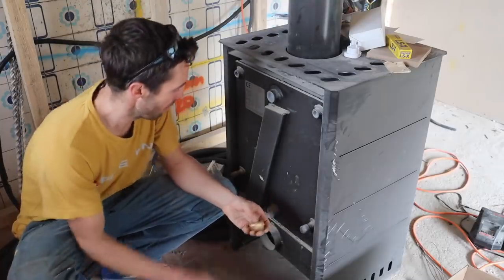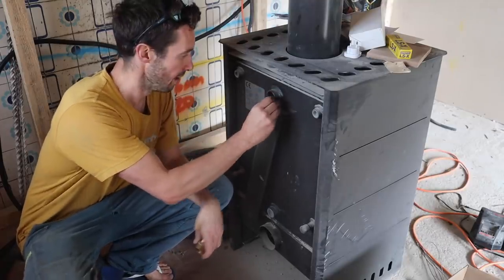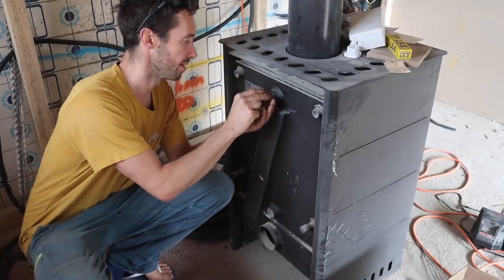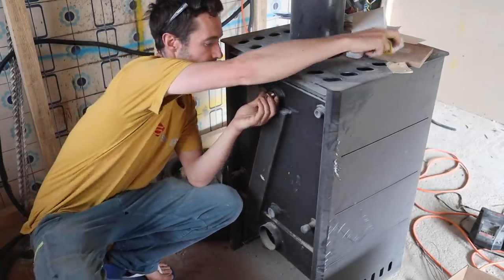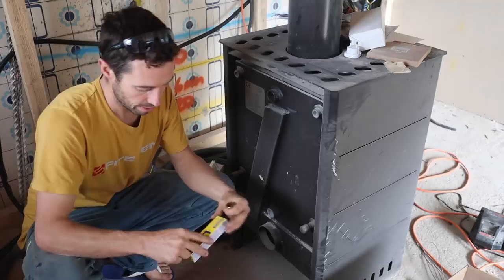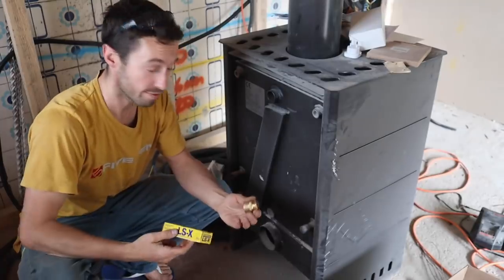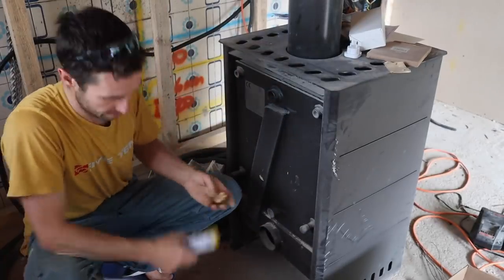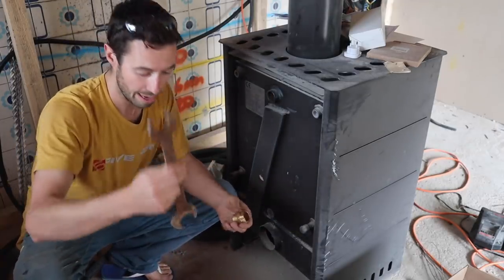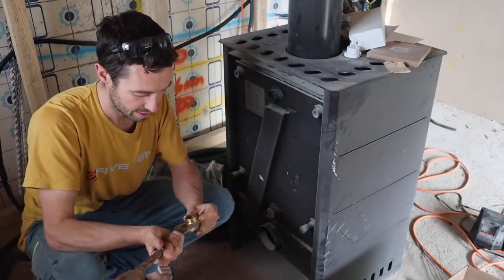This is my fire, the back boiler. The water goes in and out of these on the back. So I've got these which will go to 28mm pipe, and this is 1 inch thread, I think. To fix it, obviously this gets hot, so I'm figuring a few different things won't work that well. My dad recommended this stuff, because he used the same one, and his fire hasn't started leaking. So basically I'm gonna put this in with this stuff, crank it up tight. The old man who sold me this place had some spanners left over, which fit perfectly.